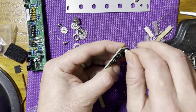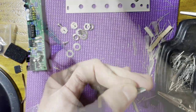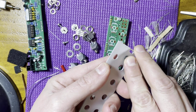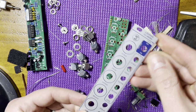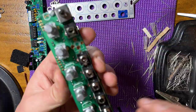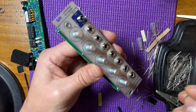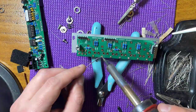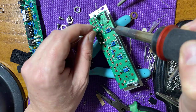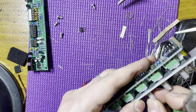The LED light pipe comes with a little black ring that holds it in place — go ahead and install those into the panel. Now it's time for the panel components. Place, but do not solder, the pots, jacks and the LED. Solder just one lug for each pot. Add the flat washer and the crinkle washer to the switch and fit on the panel. Ensure the pots are on straight, then finger tighten some of the nuts to keep it all together. Adjust the LED position against the light pipe. Solder everything up, then finish tightening all of the nuts.